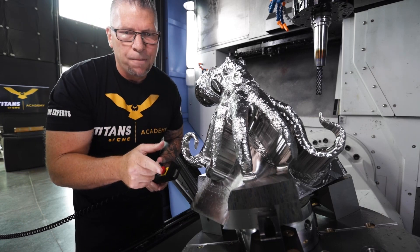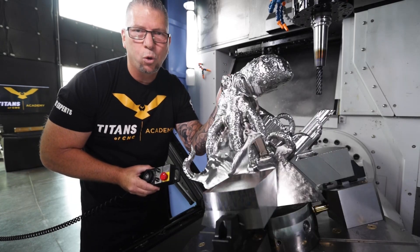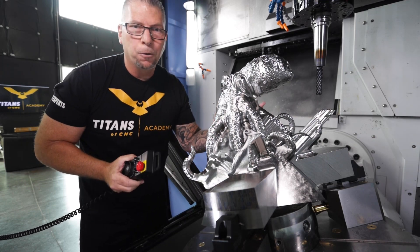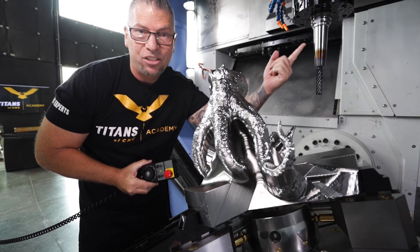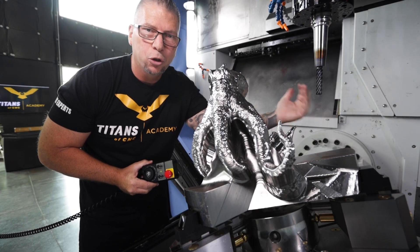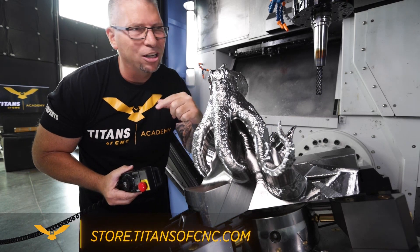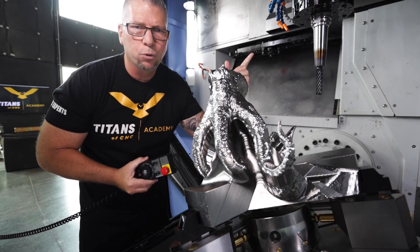I just wanted to give you guys a quick look at the fixture and some of the cool things I did. Watch the rest of the video because we're going to take these tools, drop down full depth, and get into some crazy places just roughing titanium. For those asking why I'm not using shell mills — shell mills are big and bulky. I can't get down inside these different places, and I have an HSK-63 smaller connection, kind of like a 40 taper. By the time you get that depth, you're losing rigidity. When you use the Harvey 3 and Harvey 1 TE and drop down using the full depth of the cutter with a smaller radius, your MRR is through the roof.